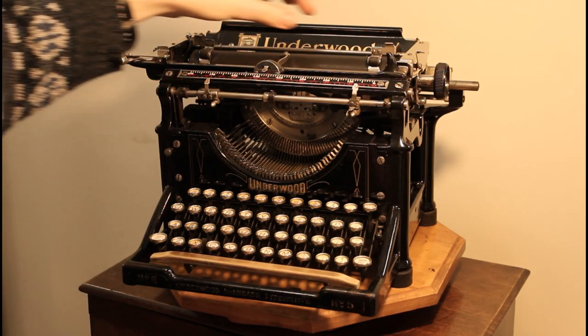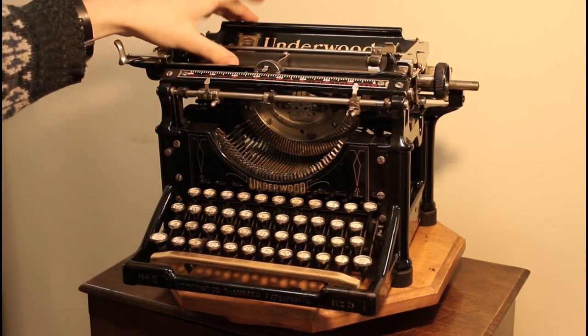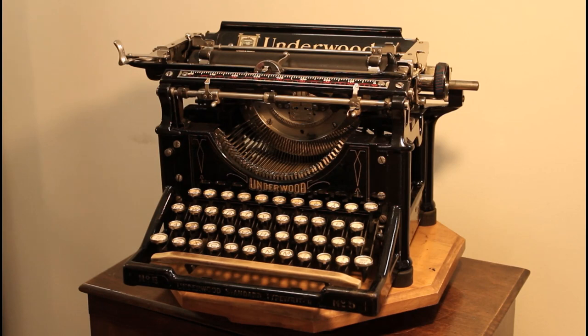And the guide that runs underneath the platen on the 1905 model is conjoined to the paper table, while it's a separate unit in 1920. So, long story short, it was an ordeal to make that work. But I've managed to do it. I had to shorten some of the feed rollers, and I created a few washers and various components to make that work, but it works now.